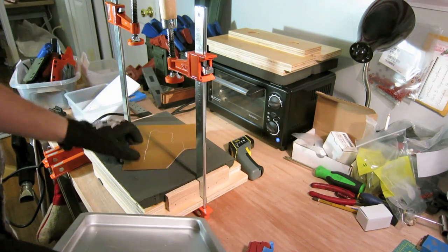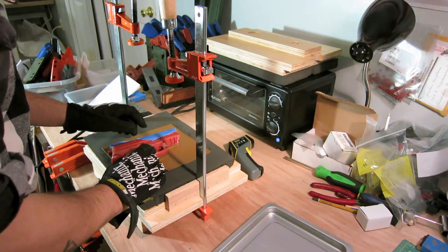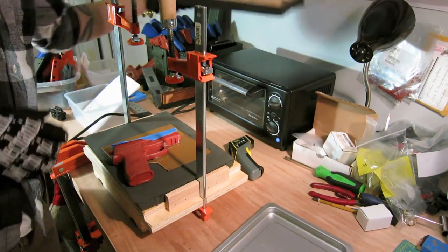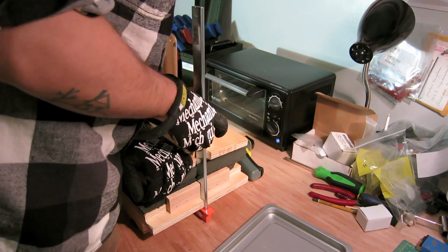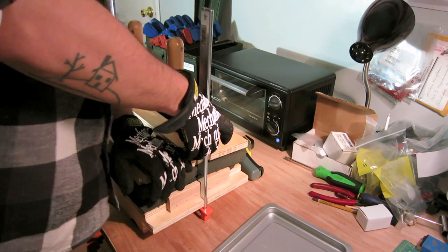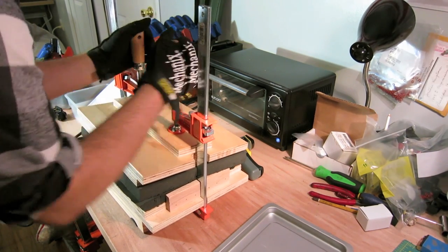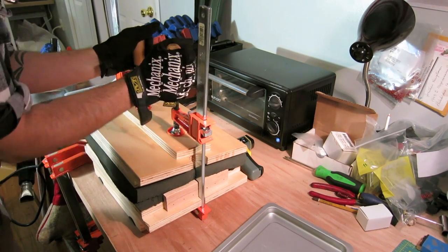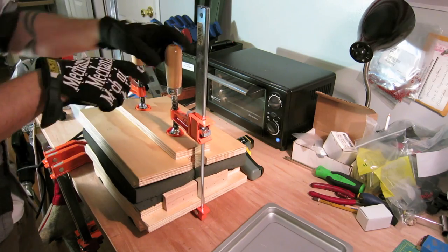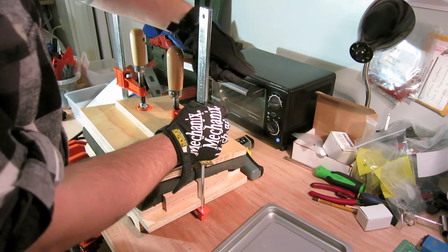Remember, you put some markings on the Kydex which you're now grateful for — so you know exactly where to lay the gun out. This guy's going into the foam — rock and roll, work quickly. It's good to have a press you can manipulate quickly because the faster you work, the less time the Kydex has to cool without taking any shape. More pressure is always better for forming the material. I do this by hand to a point, and then these posts here are cross-drilled — you can put a screwdriver in there and crank them down really tight. More tighter is more tighter.